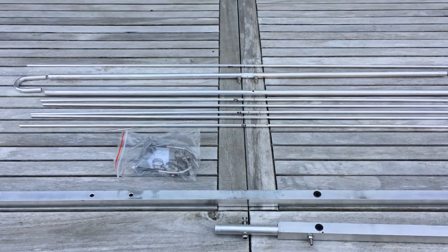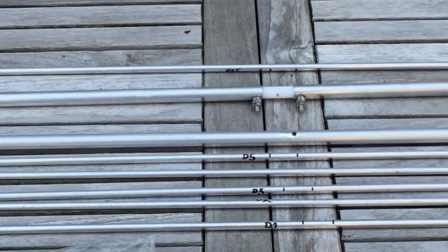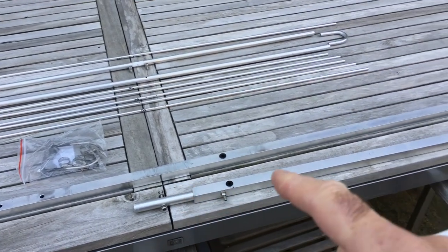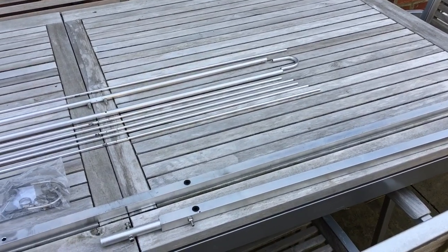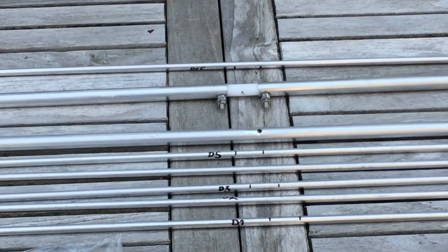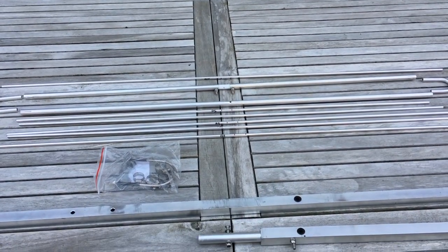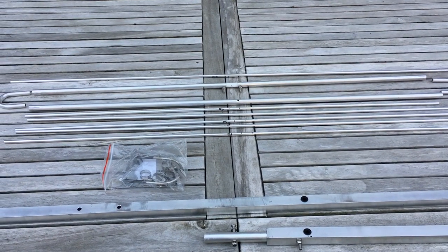If I zoom in, you'll be able to see that the directors are all labelled up. And at the end of the radiating element you can see the adjustment on both ends to get the antenna tuned for the frequency you want — for the SWR. The boom is in two parts; the smaller section connects into the main one to make it more transportable. What I didn't realise was there's no coax socket with this antenna, so you either provide your own or connect directly onto the radiating element — that's something I'll look into. You get a one-sheet set of instructions which effectively shows you the finished antenna and points out where all the elements go and how to adjust it.